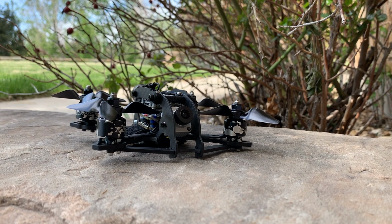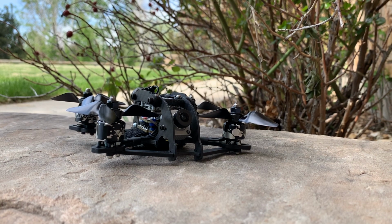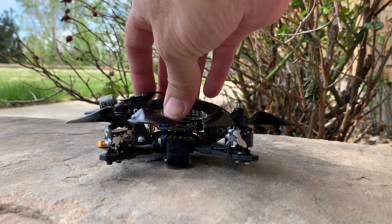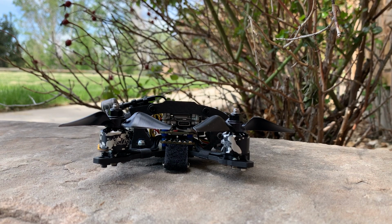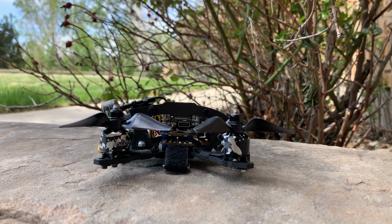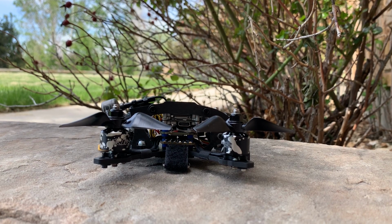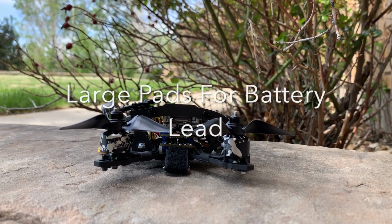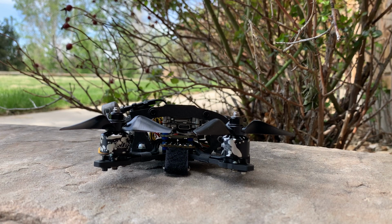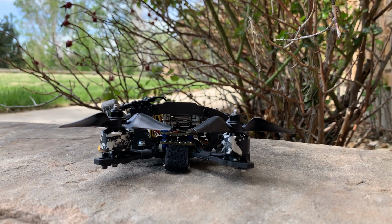So here are my thoughts on the Massive Droner HD build. Starting with the build difficulty, I would say a beginner should be able to do this build as there is minimal soldering, and the soldering you do have to do involves soldering on larger pads on the flight controller. Other than the buzzer, the only soldering that is required is soldering on the motor wires to the 4-in-1 ESC, because the wire harness coming off the Vista plugs directly into the iFlight controller. Also on the 4-in-1 ESCs, they have large soldering pads, so that shouldn't be an issue for a beginner. The frame assembly is relatively easy, and there's a good frame build video from Catalyst Machineworks that I'll link below.